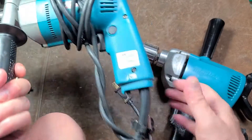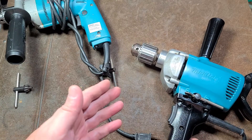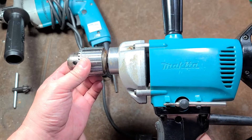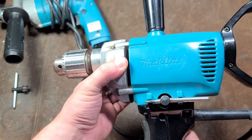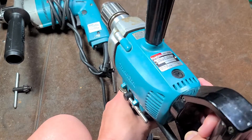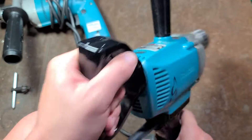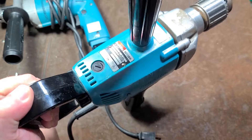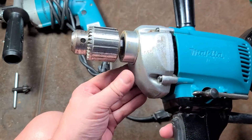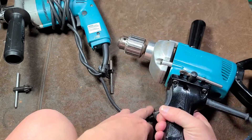That's really what it was: this pistol grip drill is pretty powerful, but it's more for intermittent use. If you're really going to do something like mixing where it's constant high loads — mixing grout, mortars, even paint — this drill is just made to run at higher continuous wattage output, like for mixing or if you're drilling a bunch of large holes over and over again on a construction site. And another advantage over the Milwaukees and DeWalts is that this is actually quite a bit lighter. This drill is light enough to hold out straight, even with my left hand, which is not something you're going to do with the Milwaukees. But it also makes it more versatile — the way the gearbox is contoured, in certain situations where you just need to drill smaller holes, you could still use this in a pinch. So it kind of made it a more utilitarian drill.